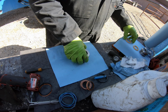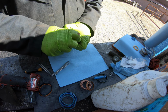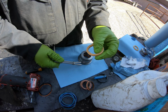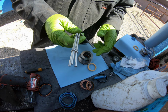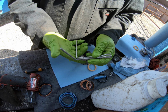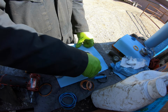But you guys have probably seen, sometimes with these little cylinders, you don't even need the tool, but this little tool works pretty good for these seals. You can get them, the U-cup U-seal installers. You can get a set of them online for about $30. They're really cheap. Probably could make something if you wanted to. There's nothing really to them, but they do help.